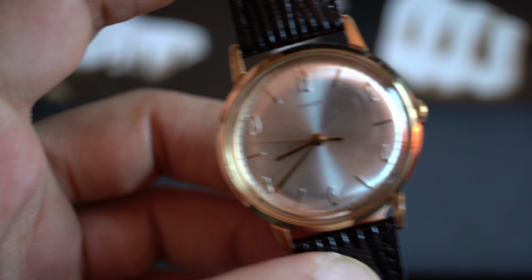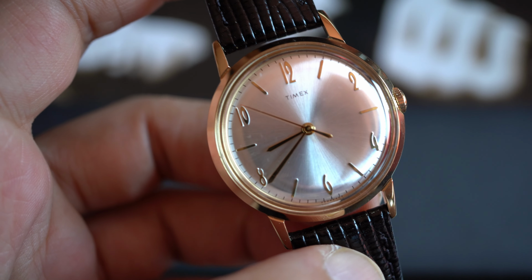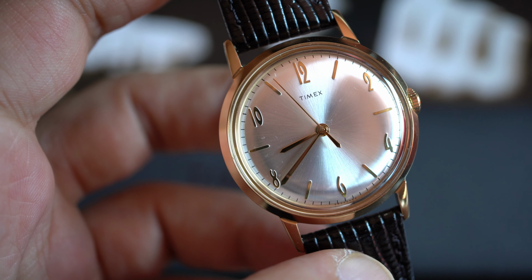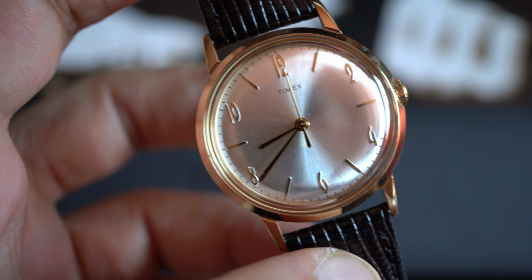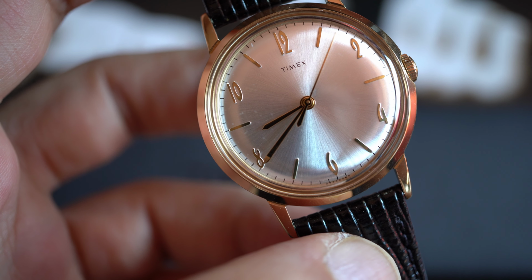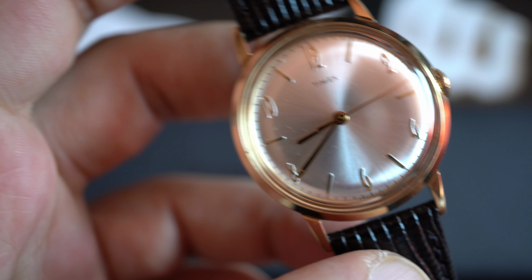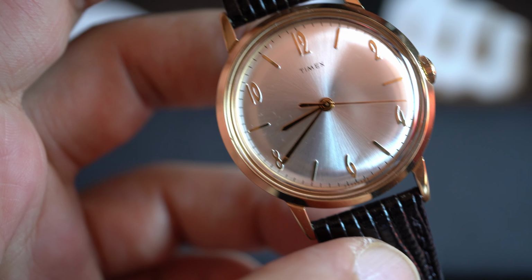They are saying that the movement is not good. The ST6 inside is a Seagull ST6 movement that was an automatic movement. Basically, like I said before, they got rid of the rotor to make a mechanical movement out of it, and it's a wonderful movement. Seagull is a company that purchased all the tools of Venus, a Swiss company, in the past. They bought them back, brought them back to China, and they are doing wonderful movements.